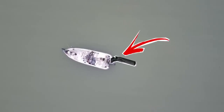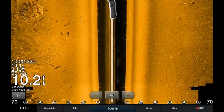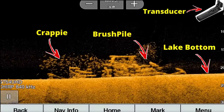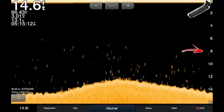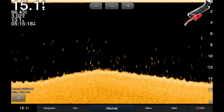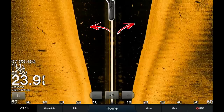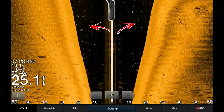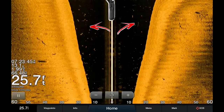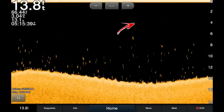Let's first talk about the transducer. The transducer is located on the back of the boat at the transom. On the screen, the transducer is actually located on the top center of the screen, unlike 2D and down imaging sonar where it's located on the top right corner. To create an image, the transducer sends a signal straight down to the lake bottom, just like on down imaging. This shows as a black space on the screen between the two gold lines — that is the entire water column directly below the transducer. This black space on side imaging is the exact same black space you see on your down imaging screen.